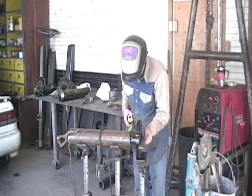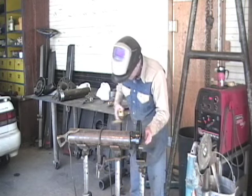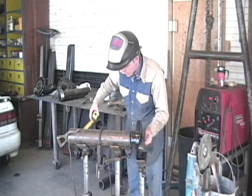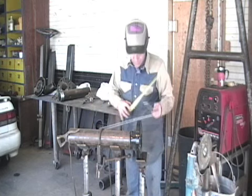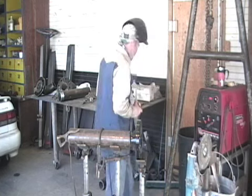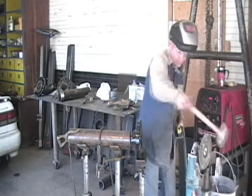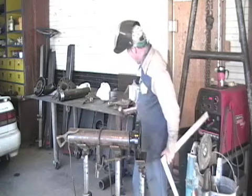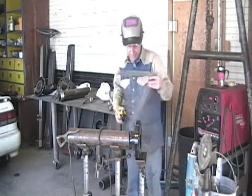So I'll come out to 4 inches in the front, and then I'll just go down here to the back, and that's way out. According to the square, this side has to go in to pull the square around. So I need to tap that with a hammer. Looks like a good shot.